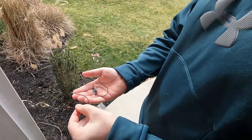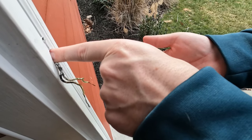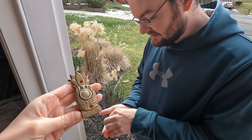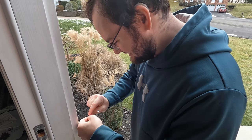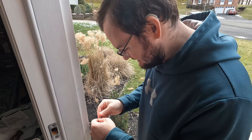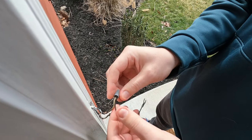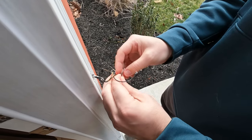We're extending the wires because the existing ones are really rusty and crappy. We're twisting them together — there's plenty of space in the hole. The key is making sure you twist them the right way and don't leave any exposed wire, because you don't want the two touching and causing a fire in the wood. I went the extra mile and added electrical tape around it — better to do it right the first time.